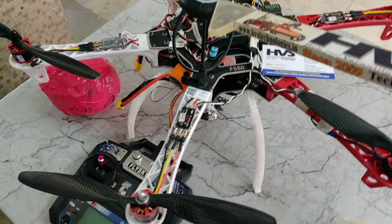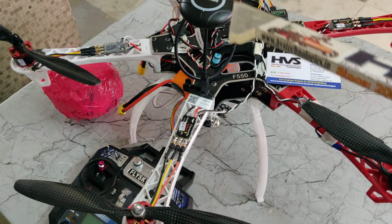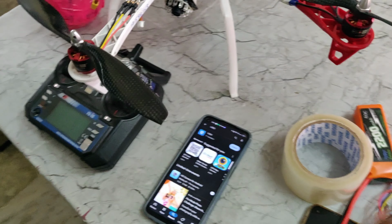And we have interfaced the GPS module, which has the compass also, and the buzzer indication. We are using a 2200 mAh lithium polymer battery pack, which is rechargeable. We are providing an extra battery through the charger, which we use to charge this battery. Just connect this at this slot and keep it charging till these three lights turn green. When these two are green, two cells are fully charged, and a third cell is charging. It will take around 4 to 5 hours based on the battery levels inside this battery pack.